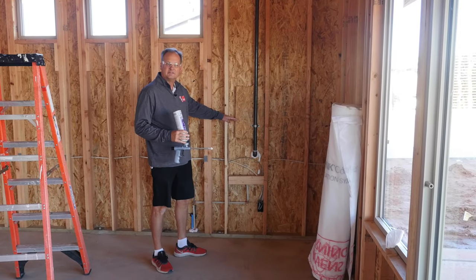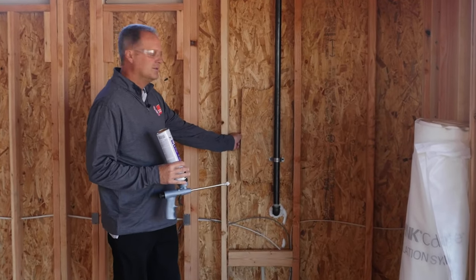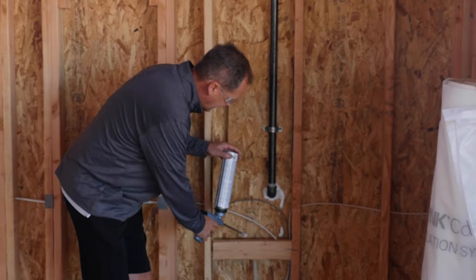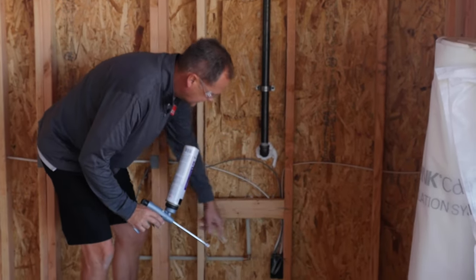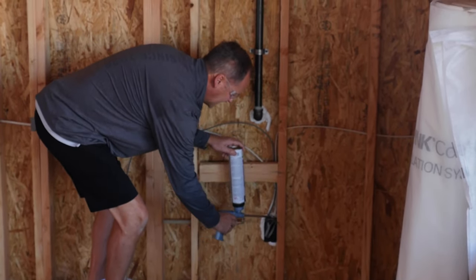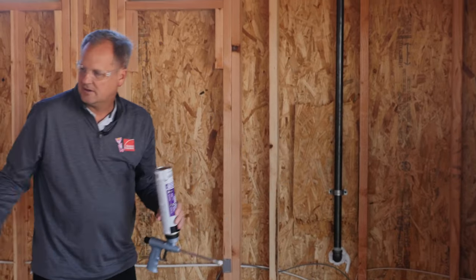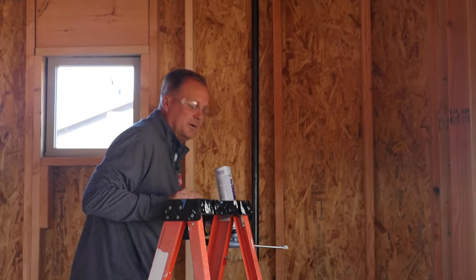This is a great cavity as a sales pitch for blown-in insulation. You can see the gas contractor has scabbed together three layers of OSB to have his gas line at the right depth. I've also got a plumbing line coming in here that we're going to foam around to make sure we get sealed tight from the outside. On a 2x4 wall we always foam behind the electrical box to make sure we get maximum R-value behind it.